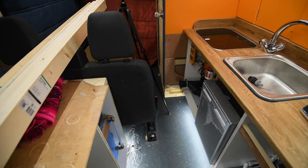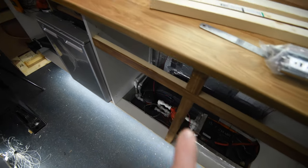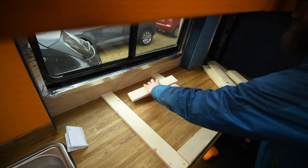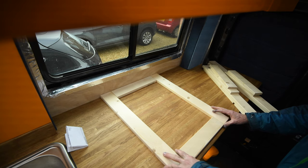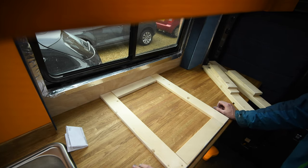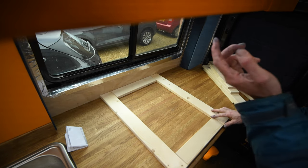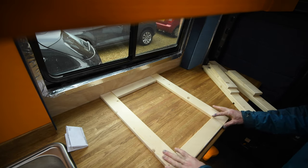I've made some framework for the rails. Last night in the dark I spent time cutting all of the stiles and rails to make the doors. The two longer bits are the stiles and then we've got the rails which go at the top and the bottom — that gets clamped together to be the door frame. I've also just bevelled the edge slightly. It's softwood from B&Q and a sharp edge over time is probably quite susceptible to chipping.